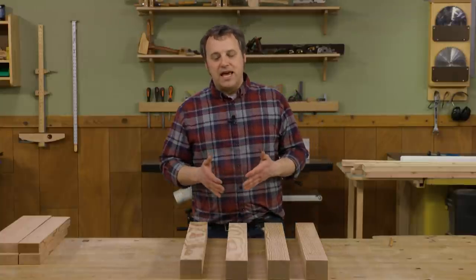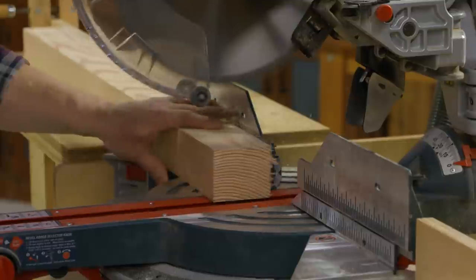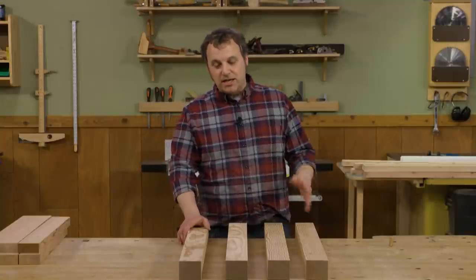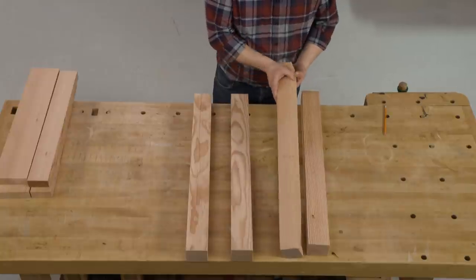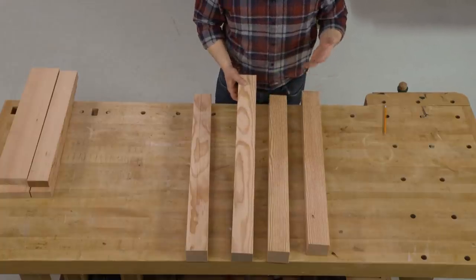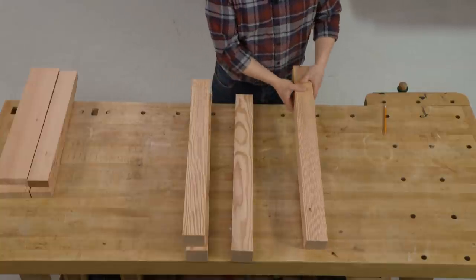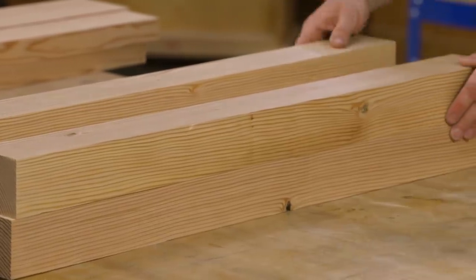The legs were cut from some old salvaged Douglas fir beams. I cleaned up one end of each leg at the miter saw, then measured, set up a stop block, and cut all four legs to the same length. Now, I have four legs that are all the same length but they don't look the same. Two of the legs have really nice straight grain on all four faces — that looks really cool. The other two have straight grain on the edge, but the face has a wild plain-sawn figure. I want this bench to look the best it can, so I'm going to put the two legs with straight grain on all four faces at the front. When you look at the bench from the ends, you'll see just straight grain — the best look I can get.